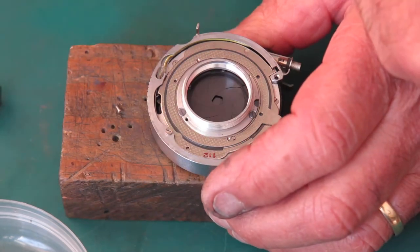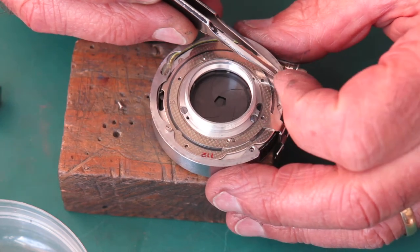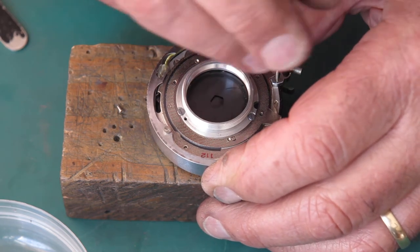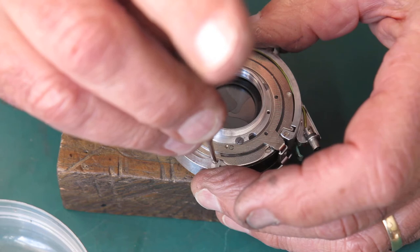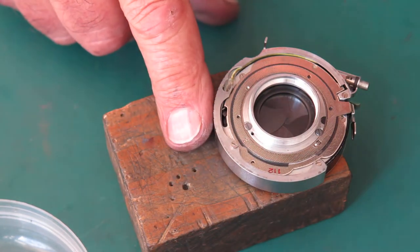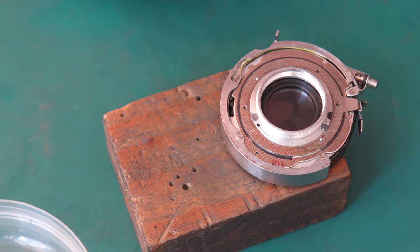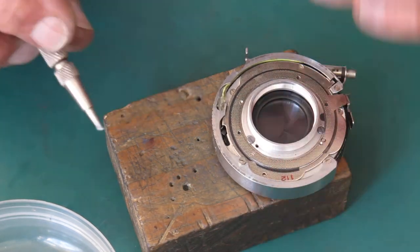The two small countersunk screws are different diameters. The smaller of them runs into this little tab on the end here. The larger diameter one runs in there. Don't quote me on it, I think they're 1.2 and 1.4 millimeters. Now flash contact there, I just want to tighten that screw on the side of the case. But I've lost my screwdriver. Found it, I just put it back in the wrong stand. Let's do that screw up.